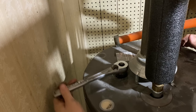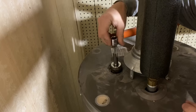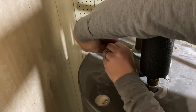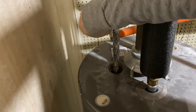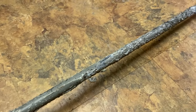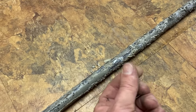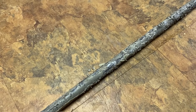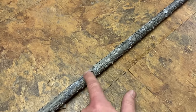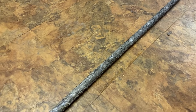Still draining the water here at the same time that I'm working on this. And here is the source of the rotten egg-smelling water. You can smell it — just how this reacts with the water chemistry. This magnesium, it just stinks. It smells like rotten eggs. This whole thing does. And that's what causes the water to smell like that — all this debris and stuff that flakes off of this thing ends up sitting at the bottom of your hot water tank and just continues to make the water smell.